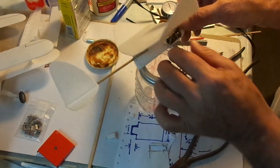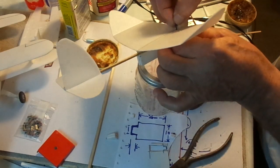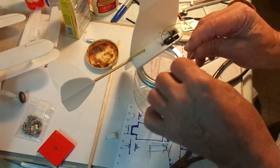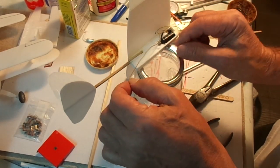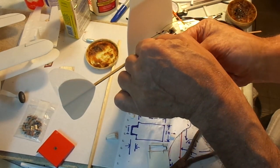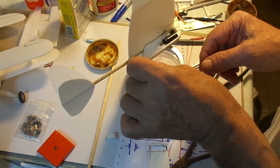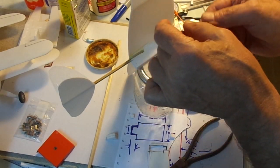And there it is. And we can bring it down, bring the heat shrink right down through there too, I think. Yep. All right, that looks nice. And then we're going to route it nice and neatly if possible. It's going to go on that negative capacitor lead, just the way we did that other one. And you see, this thing only needed to be about a half an inch longer than what it was, but that's the way it goes.